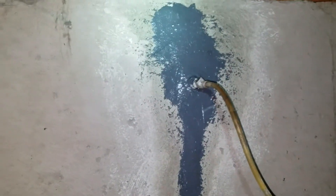We've already applied the paste along with the spouts everywhere there was a crack. And now we're injecting epoxy to seal off the crack and ensure the structural continuity of where the crack was.